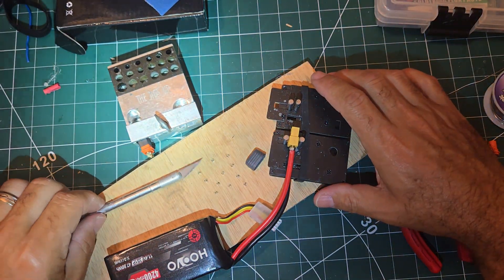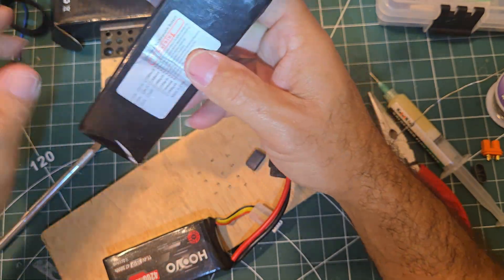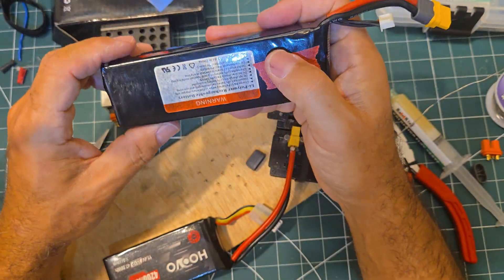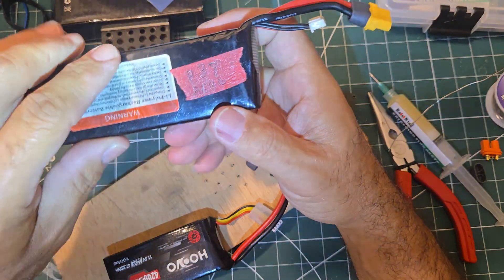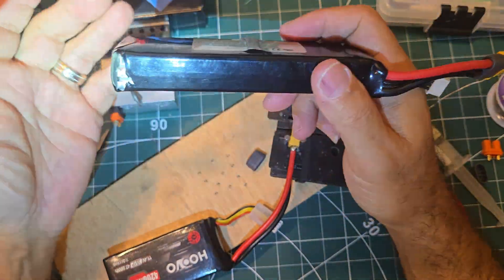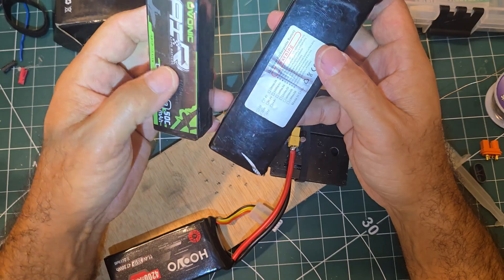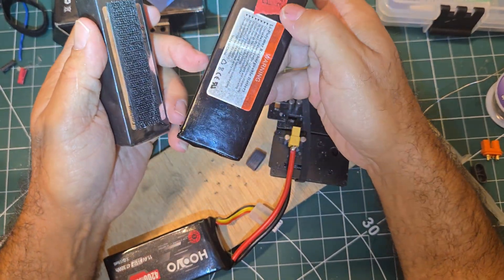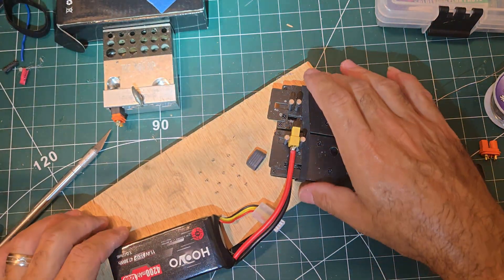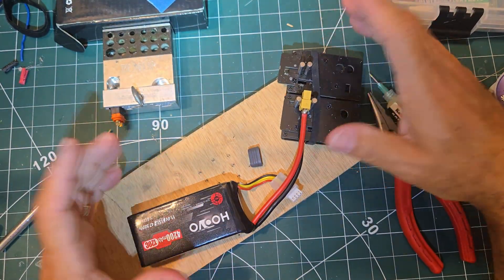This is the battery in question. I got this P38 project and the battery the previous owner had stuffed in it for who knows how long didn't even have a name plate — I don't know the brand or the C rating. It still has good voltage so I'm tempted, but also a little afraid. It's a 3S 3300 and barely fits in the cavity. I have a 3000 that fits easily, but it's only 193 grams versus 259 grams — a big weight difference. So I looked around and found these 4200 120C packs.